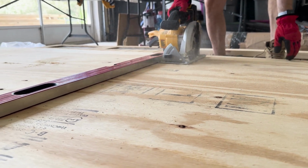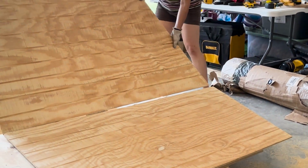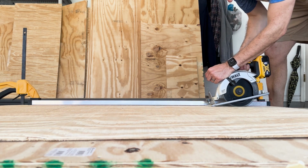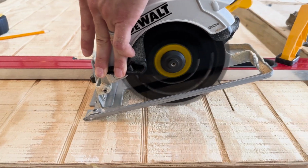And then we cut the siding for the two gable ends. We clamped 2 sheets of T111 together and cut them both at the same time so we'd have a perfect match. To cut the access door on the gable wall, we made a plunge cut with a circular saw. This removes a minimal amount of material and allows us to use the offcut as the door.